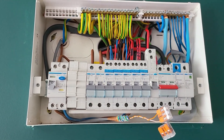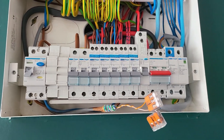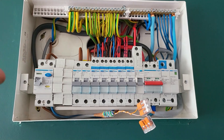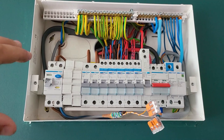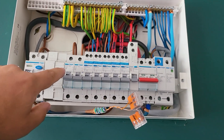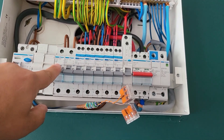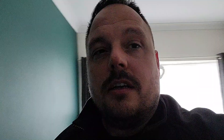However, if you're installing your cable in a way that warrants it, you still have to comply with the intent of the wiring regulations. Because this is an equivalent of NYY cable and it's not armoured, we wanted to put an RCD on there because it passes through the cavity - just a bit of belts and braces. We've gone for a double pole RCD, essentially feeding it with overcurrent protection from an MCB, and then the final circuit goes out from this RCD to the charge point. It could be argued it isn't necessary because the main tails on this board pass through the cavity anyway with no RCD protection.